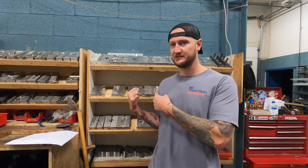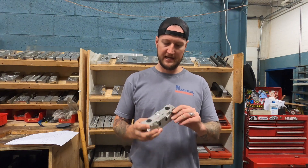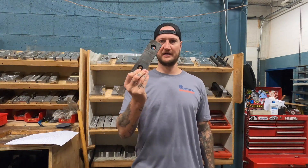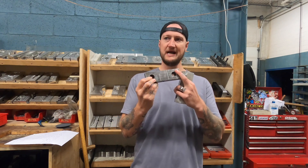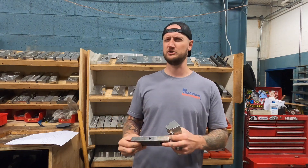For those who don't know, just to give a little background: some of you may not have used soft jaws before, some of you may just be getting into the trade and aren't familiar with all the different kinds of work holding that go into running a CNC machine. A soft jaw is typically a piece of aluminum drilled just like your typical jaws. This is a soft jaw — and this is a regular hard jaw. Those are the counterbores and screw holes for your vises, fairly standard setup for Kurt vises but they also fit on double vises.